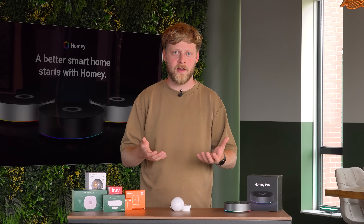What is also good to mention is that Zigbee devices don't always need a Zigbee coordinator to function. If you go to IKEA, for example, and you buy one of their Zigbee bulbs together with one of their Zigbee remotes, the two can also be connected directly to each other via a Zigbee binding. In this case, if you press a button on the remote, it will directly be sent to the light bulb. It's good to mention that next to the connection they have with each other, they can also be connected to a Zigbee coordinator like Homey at the same time.